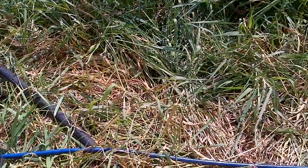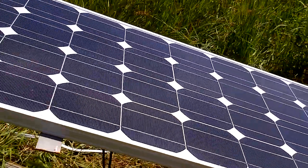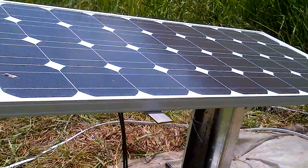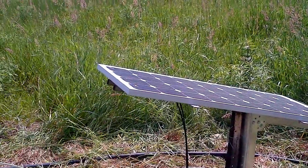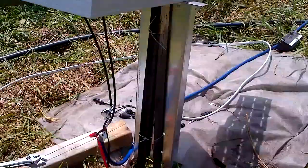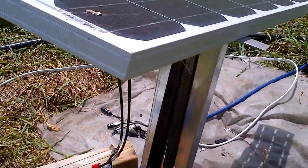The cable itself is just two-wire, 12 gauge, running directly to the solar panel. The solar panel is connected directly to it. We do have a float switch we'll be putting on in a little bit, but this time of year the solar panel almost sits perfectly flat, which gives us maximum output. Right now I'm reading off the panel under load: 10.6 volts, and the pump is working quite well.